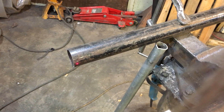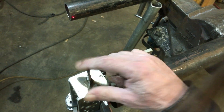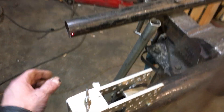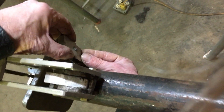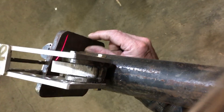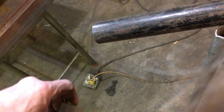I don't have to put any kind of target on the other side — I can easily eye up a quarter inch. When I put my next plate on, it'll be directly in line with the plate I have. No lasers I've seen are ideal — even this one is too long. If it were about half this width, that would be even better because you never have much room on the base plate. You don't want to stick it on the other side because then you have to put a target. This way we just stick it on there and already have the target on the other side where the next base plate is going to go.